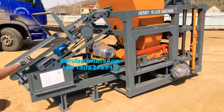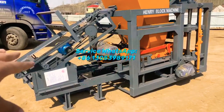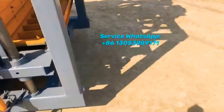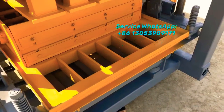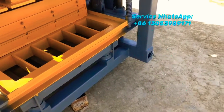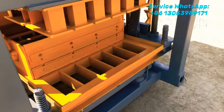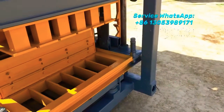Because we are packing the machine now, this part — we call it the block carrying or block transfer system — is detached. Normally these parts are fixed in front of the machine. After the blocks are formed, the pallets are pushed out and the pallets and blocks together are transferred onto the block transfer system, connected with the block carrier — a trolley or small vehicle — to carry the blocks to the curing area.